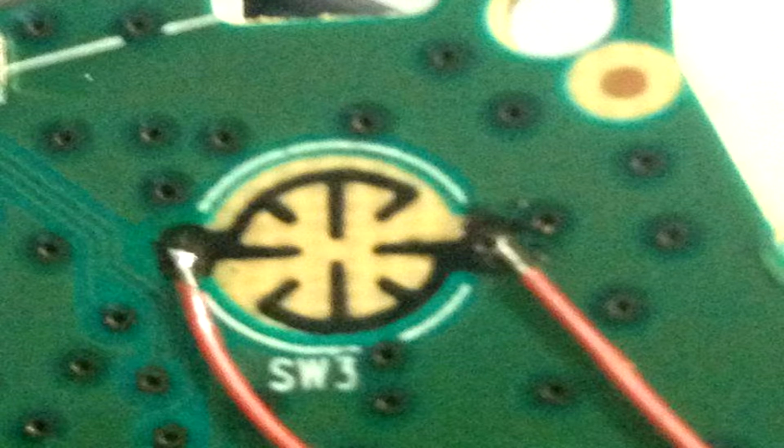Using flux is a huge advantage. But you definitely need something small to apply the flux, because the paint brushes, or whatever they give you, are huge. So I suggest a tack or a toothpick. Toothpick's probably best, but you might need a tack to scrape off the carbon on this. The black is carbon, from what I've understood. If it's not carbon, correct me in the comments below. So you're gonna need a tack anyway, so that's a good thing to use to apply the flux to the small spaces that you need it in.